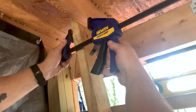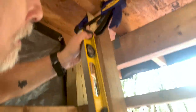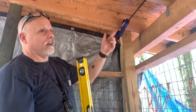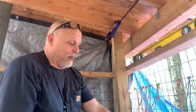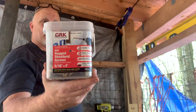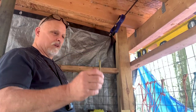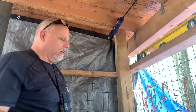And you know me, I'm not buying one. While I was at the store, I picked up a pair of Irwin Quick Grips — actually one — because it's like a second set of hands. It's hard to hold this and level it and screw at the same time. You may be wondering what kind of screws I'm using. I'm using 5/16s by 4-inch screws. Four-inch might seem like a little bit of overkill, but I'm okay with it because it's up in the rafters. I'm using T-bit screws because you can really crank down on these things, and this is going to have a lot of weight on it, so they're thicker than your regular screws.